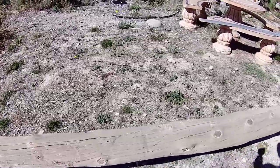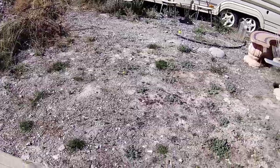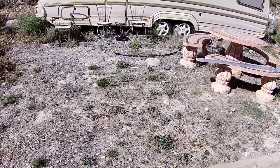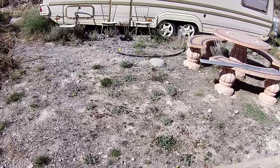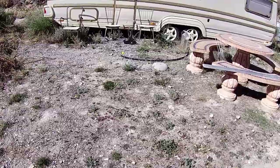I'm thinking I'll measure about halfway, thinking that the post at the bottom is going to be heavier, and screw some eyelets in. It'll give us something to connect the digger and the straps, or the chains to, and lift the post up. It'll also give us something to strap to with stakes to keep the post in place later whilst the concrete sets.